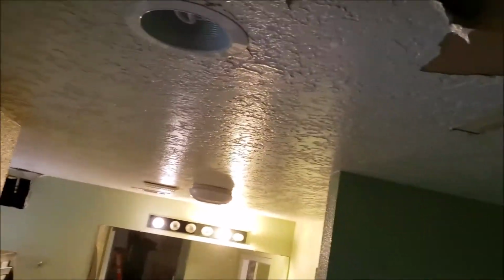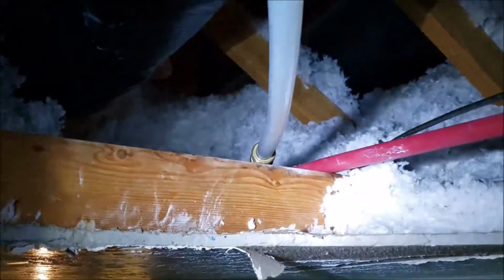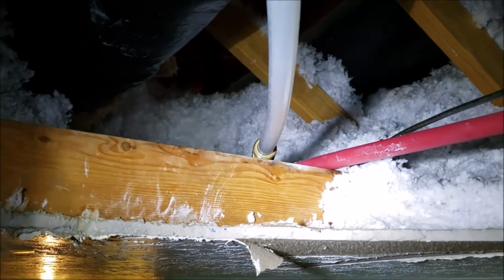Which will be on a separate receipt, and that was the one that was right here in the hallway, right there. And so the second one, it was leaking over here, and we documented this already, but I'm going to show you the repair. It was right here, and let me grab my flashlight from up there. So that guy is right there. That's where I repaired it. From there to there with blue PEX, which is what we had on the truck. And of course we had another leak over here. So what we did is we just moved the coupling over.